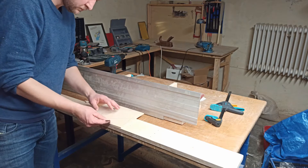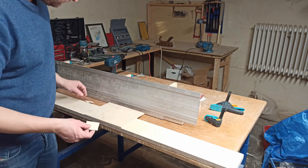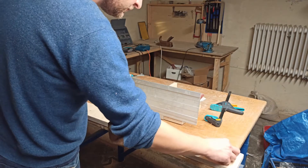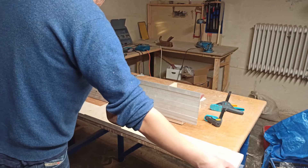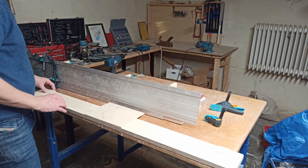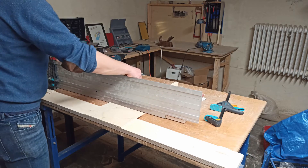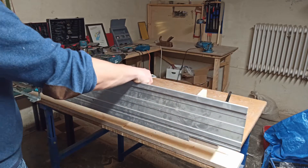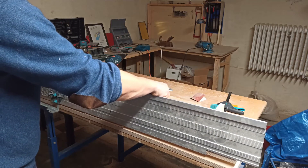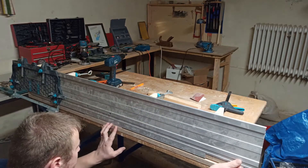And here's how it works. You just need to put a spare wood on a workbench and another piece to support the plywood further back, and then the plywood you want to cut on top of it. To keep the jig from bending, it is a good idea to also put some smaller pieces of plywood to the ends of the long spare wood. On top of that you put the jig with the attached guide for the circular saw. The backside of the jig is being pushed down with another long piece of plywood and a clamp on each side.